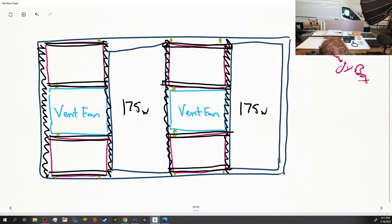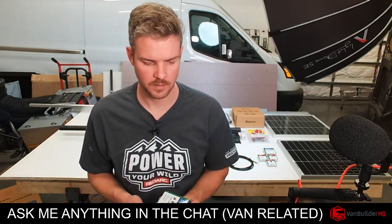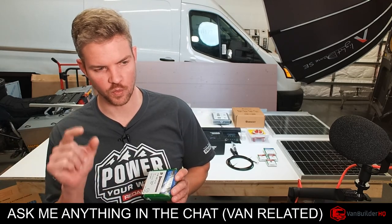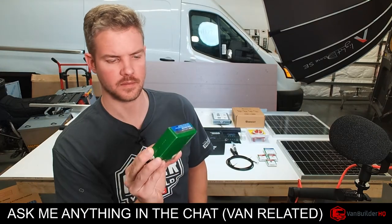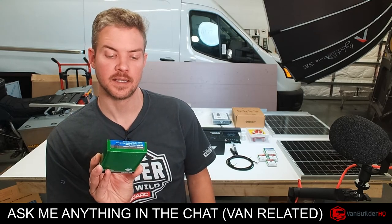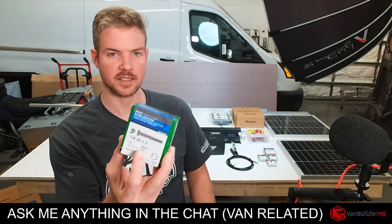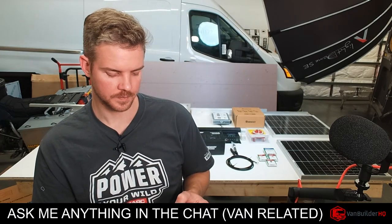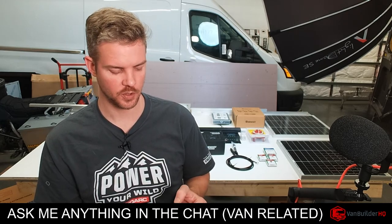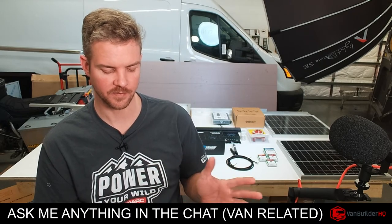And we just picked it up from Lowe's. And then what we'll do is back here behind me, we've got some hardware. Since our cross members on the roof are 1-inch and our tubing is 1-inch, we went with 3-inch bolts. These are hex bolts. You don't need socket head cap screw bolts or stuff like that. Just a simple hex bolt, but you need to make sure it's stainless. Everything on the roof needs to be stainless. Or if it's extremely well painted, you can get away with painting stuff, like using Rust-Oleum black to paint it black, like for example those screws.